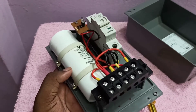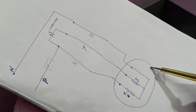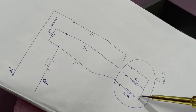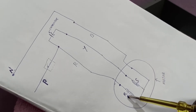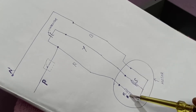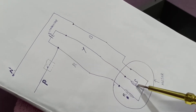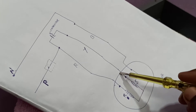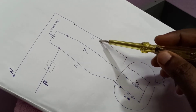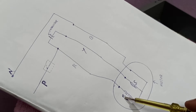Let me explain the same thing with a circuit diagram. Here you can see a circle representing the motor. Inside this motor there is one run winding and one start winding. From the run winding there is a red cable going outside the motor. From the start winding there is a yellow cable going outside. There is one more wire — the blue — which is the common wire shared by the run and start winding.